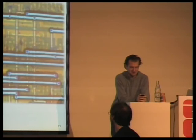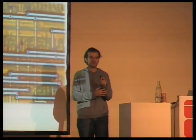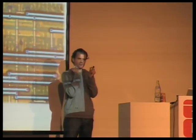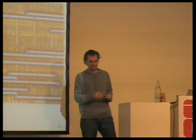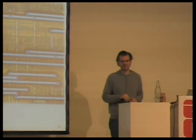Interesting. Yeah, I'm working with one right now, and the idea of a physically unclonable function is ingenious, but the execution I've seen so far is definitely breakable. So, a physically unclonable function works off the principle that the key to a cryptographic function is generated by different chips just naturally being different. Like humans are always different, even if they are twins. And so you build two chips where the process variation makes them different enough so they're cryptographically distinguishable. And the idea is to make the differences so small that nobody who probes into the chip can find the differences, because you already broke it in the process of probing in. Which, in theory, would work. Only the PUFs that I've seen do not adhere to cryptographic principles. So you can break them without even reverse engineering what they're doing from the outside.